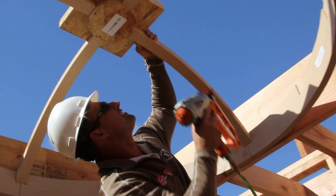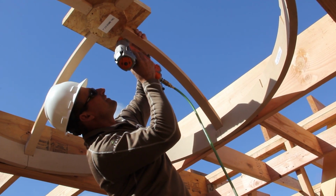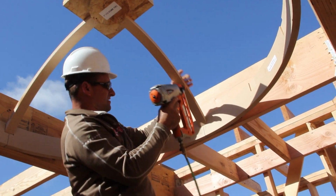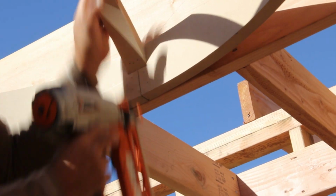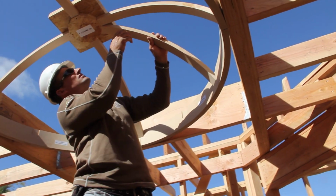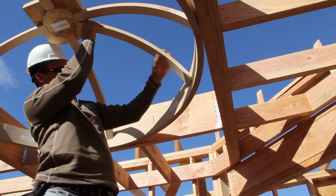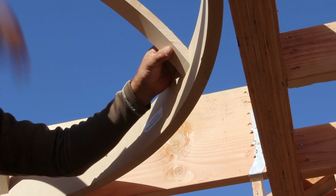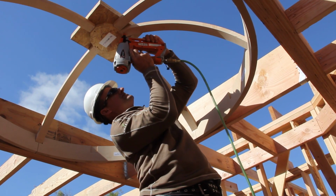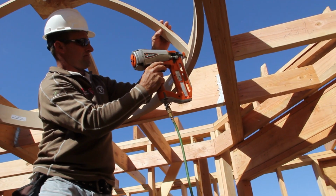It's still easy, but this dome comes with the preformed slots, which kind of snap into place. As you saw that, Paul kind of snapped that one in place. As you put a rafter in, you're actually putting it up against the dome tie, and then you're applying pressure up against the ring. Watch him do it right here. And it snaps in place. You can actually probably let go of the rafter and it'd be self-supporting at that point, because it actually sits on a little bit of a ledge, about a quarter inch.